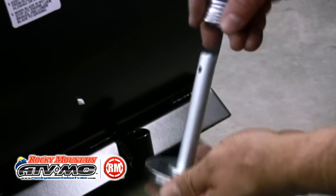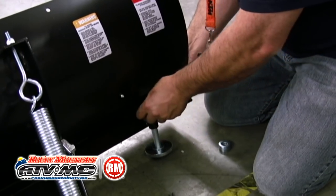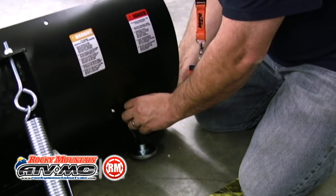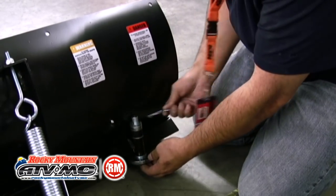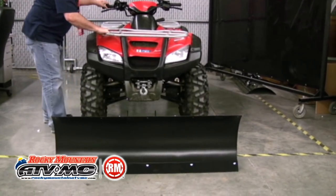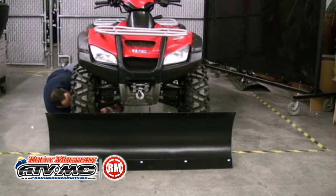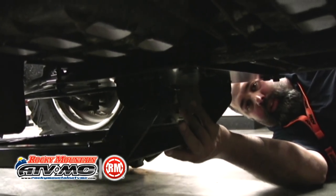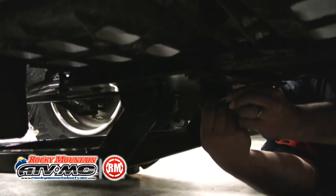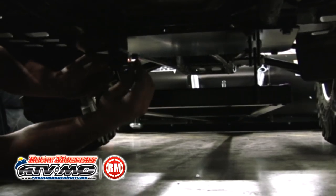The skid is primarily used when you're plowing on a gravel or dirt surface — it keeps the blade up. There are several different washers and spacers that come with it, primarily to adjust the height of the skids. We're going to put one washer on the bottom and the rest on top and adjust that later on. Now that the push tube and blade have been assembled, we're going to attach it to the ATV, which already has the mount plate attached. Slide the ATV over the plow, lift up the end of the plow, and slide it into the ears of the mount plate. Insert the straight pin and then the hair pin to keep the pin in place, and do the same on the other side.